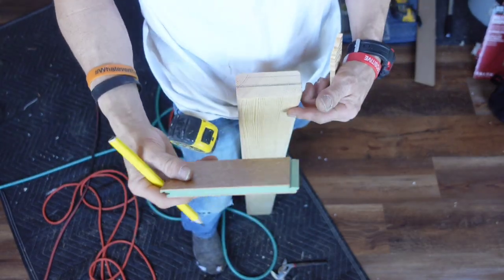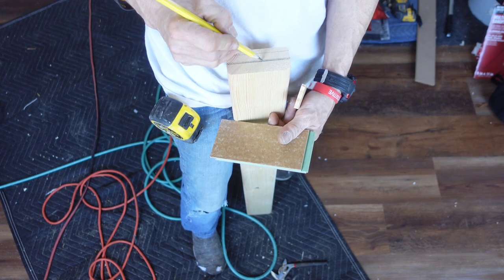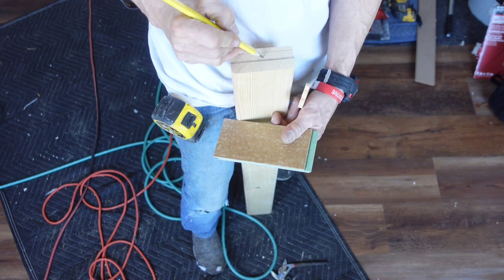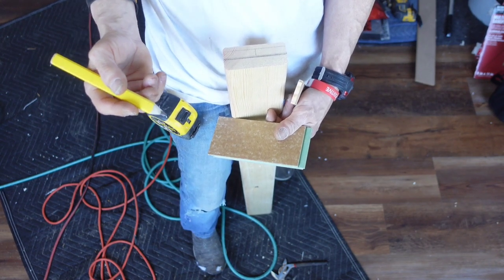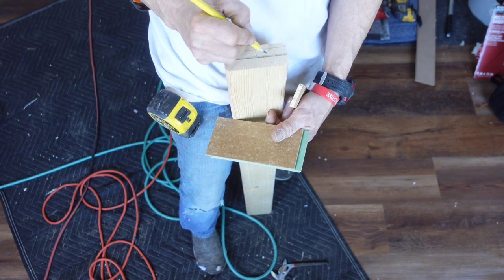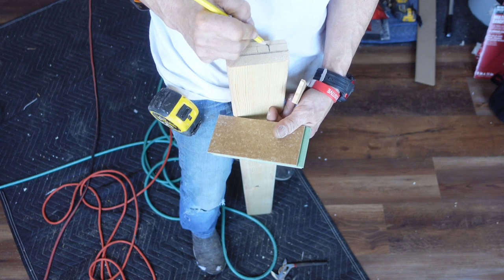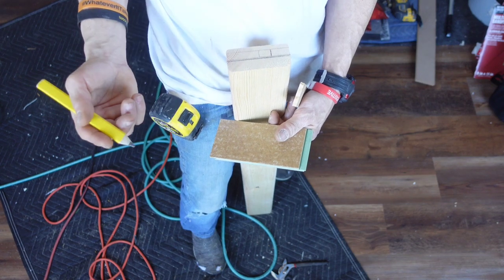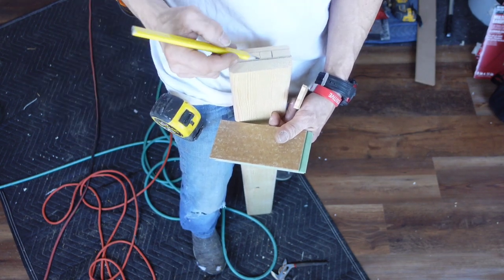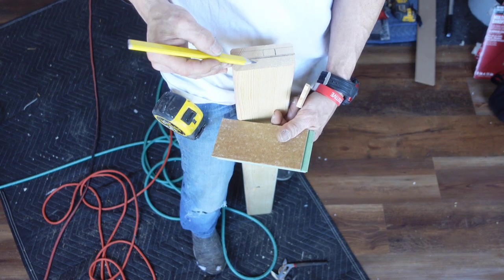Now I have my two marks on there - how I want this thing to look. The thickness of my floor is going to be sitting on the actual floor over at the landing. Plus there is the pad, which is about that thick. So if I want this to lip up on top and then sit down on top of the floor, I need to make a mark somewhere about right there. That may be a little too big because we're lifting way up on that floor, so let me bring that back some.